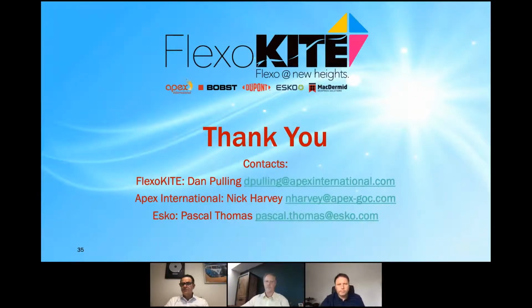Yeah, thanks for the question. We sort of tried to avoid talking about some of the product in detail, but in terms of what we did, we basically took 4 or 5 different plate types, tested that on a few different substrates, different combinations of ink and anilox volumes. And what we did is we looked and evaluated which screening patterns were working best on different conditions. And what we're left with is, I think, what was shown on one of the slides there, where we have 8 different surface screens now for white ink.